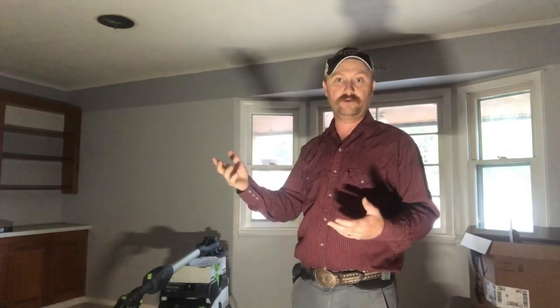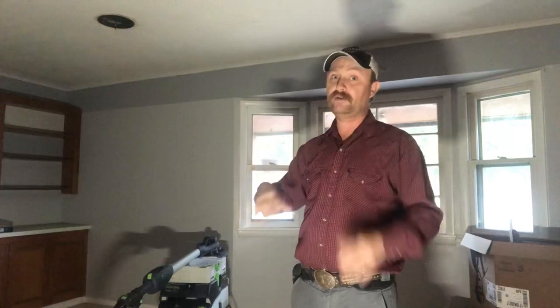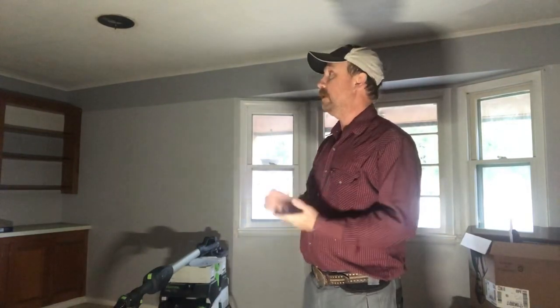You could do an entire 1,600 square foot home down to knockdown texture in a good six-to-eight-hour day. If you want to go smooth, after your 40-grit pass throw an 80 on — it'll take it to smooth in about the same amount of time. Then skim with a 120 at the end to make sure it's perfect. After that you'll need to touch up anywhere they didn't properly do their drywall work to begin with, so be aware of that. You're looking at a couple of days to get it really good.